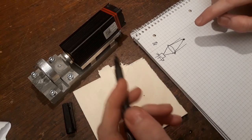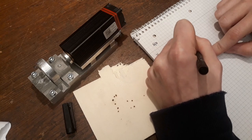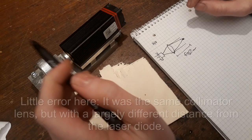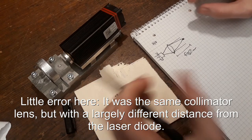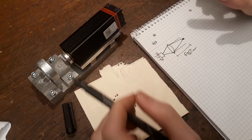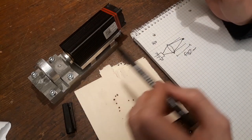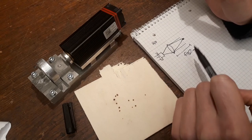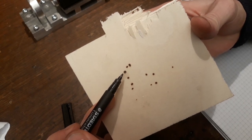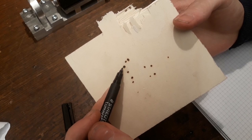I thought that this should be the solution — not a problem, right? We've got the focal length here, and I just said this is 250 millimeters. But that actually did not work quite as I expected. I had another collimator unit that would focus the laser beam onto a focus point with a focal length of about two to five centimeters — about two inches — and that worked very well: a very fine, circular, perfect spot. But on this long focal length, it just wouldn't work. You can see here what I mean — this is a very defocused spot, not very focused in one spot. The energy density is relatively low because we've got such a big surface area on the burn.